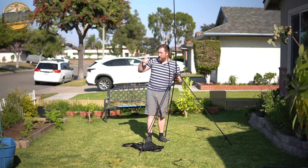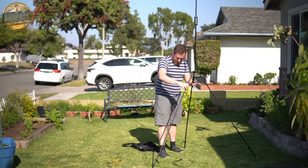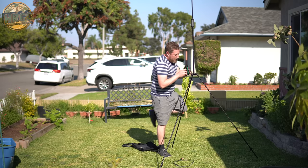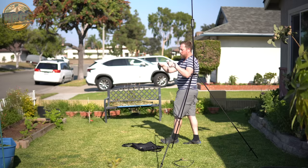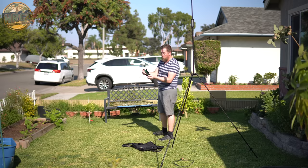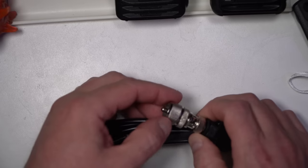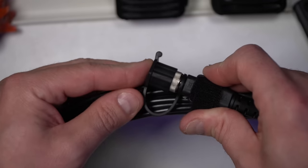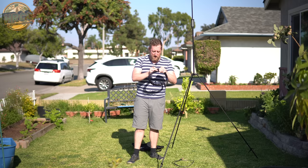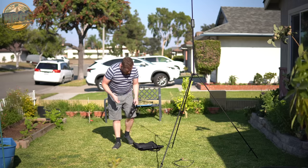I'm setting this up for 20 meters, so I'm factoring in the space I'm operating in and adjusting the tripod legs to be evenly splayed. Winding from the kite winder, I'm going to start seeing heat shrink tubing — that would be for 10 meters or so, and I think the blue is 20 meters but I'll double check. Next I'll take my feed line — these nice little rubber collars attached to it — unwind it and run it into your shack or portable setup. There is a coax adapter that comes with the kit: a BNC to BNC cable, which is great for QRP radios that generally have BNC connectors.